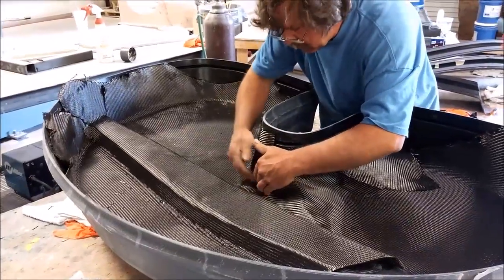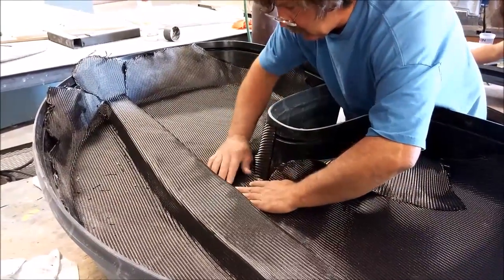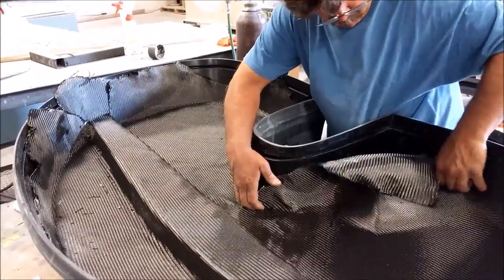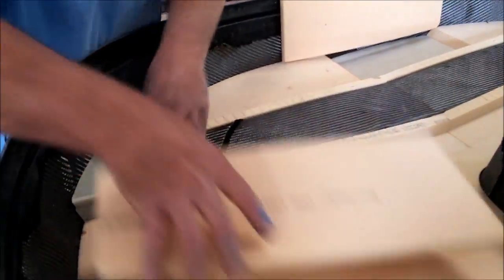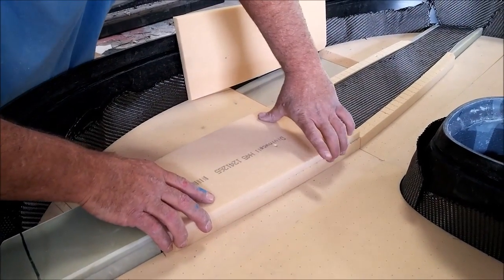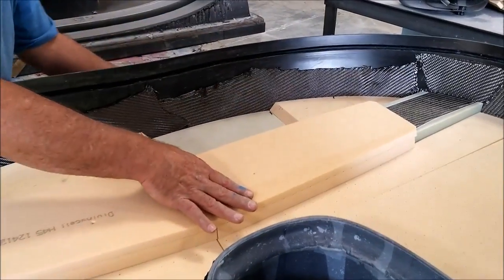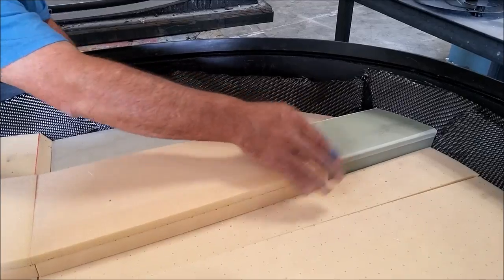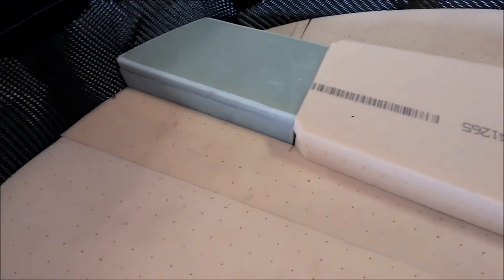Here's Jeff dry fitting the first layer of carbon fiber in the forward bulkhead, just making sure it's all going to fit nicely. This is a different carbon fiber than we've used before — similar weight to the heavy stuff for making molds, but with a different weave and more structural. You can see Jeff laying in the core pieces and the hard points. There was quite a bit of work involved, which is why we're going to simplify this part for production. That end point is where the spar attaches, that hard point is where the pressure outflow valves mount, and that's the other side for the spar. Next up, we'll be creating some parts — thanks for watching.